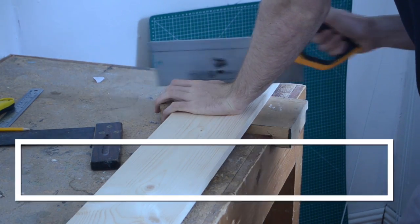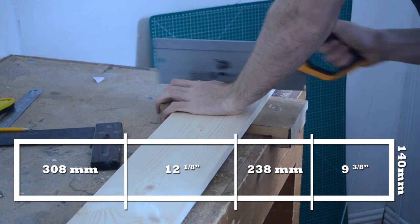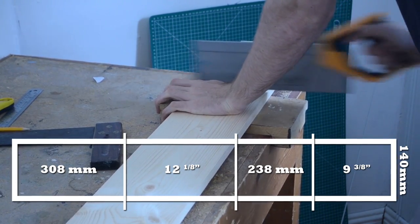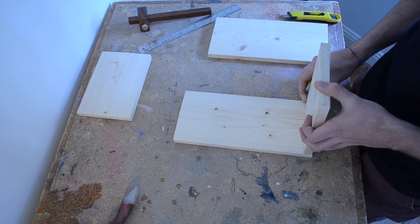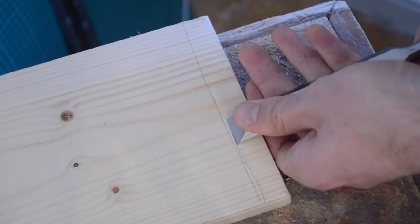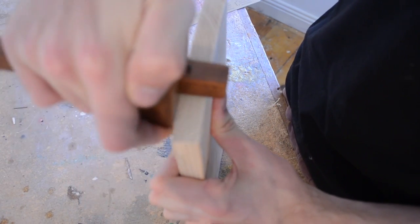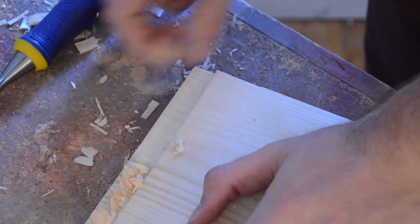Now that we have the Tetris-y part, let's make the lamp part. Cut the wood to size. I used a board 140mm by 19mm and cut the length to pairs of 308mm and 210mm. This means once the box is joined, you'll have a box of 238mm by 308mm by 140mm. I'll include metric and imperial measurements in the description. Begin by making two rebates in each end of the longer pieces. Do this by placing the end of the shorter piece on the end of the longer piece and drawing a line. Chisel into this line to create a shoulder for your chisel. Set your marking gauge to 5mm and use it to mark the depth of the rebate along the end of the plank. It's important that this line is visible.